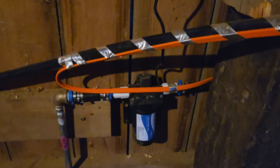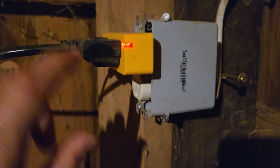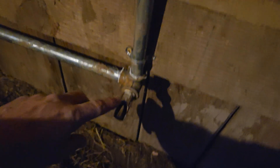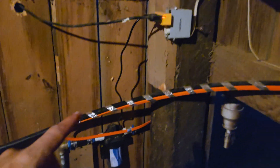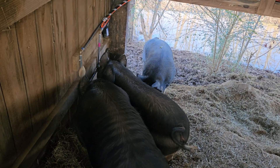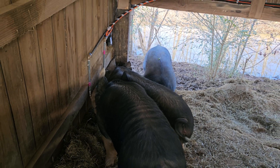Just wanted to give an update — it is the next morning, it's 28 degrees, about 7 a.m. Sometimes when you do experiments like this they don't always work out, but I'm very happy to report that this one is working out flawlessly. You can see the outlet kicked on because it's below 38 degrees. The heater cable is very nice and warm, so it's keeping the poly line and the PVC outside from freezing. The pump is turned on and the pigs have water — so with no effort from me this morning, pigs have fresh water all day long.